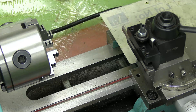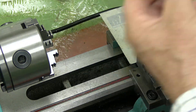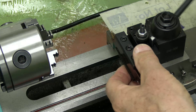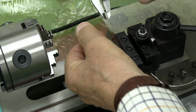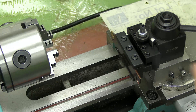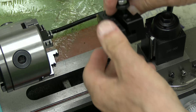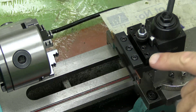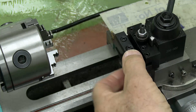Too much downwards force is exerted on the tool by the workpiece. And then I've got this, which is narrower, 2.2mm wide, and an insert which is quite nice. But on the other hand, it has this auxiliary mounting which has the effect of pushing it at least a centimetre to the left, which is not desirable because we don't want this overhang here.